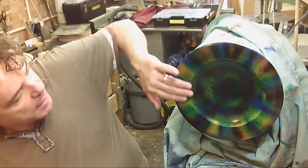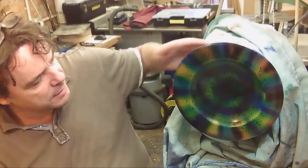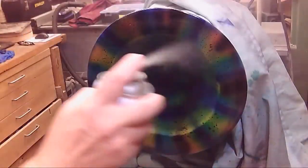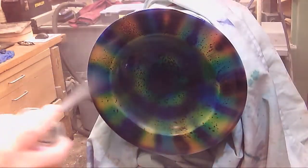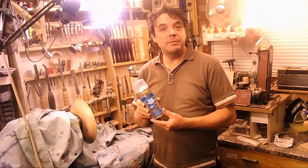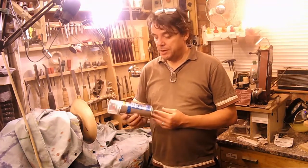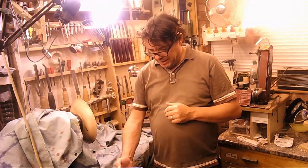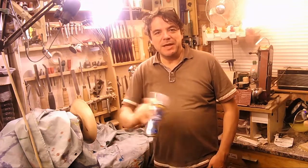The next day, the platter has dried overnight — almost 24 hours. What I need to do now is seal the colour. I've put some chestnut acrylic sanding sealer over the top, which seems to help with the final coat of lacquer going on. Now that the acrylic sanding sealer is dry, I'm applying clear lacquer from a brand called High Coat. I'm going to put about three, maybe four coats on — it recommends leaving about 15 minutes between coats. I should be able to get that done this evening coming in and out. Let's get the first coat on.